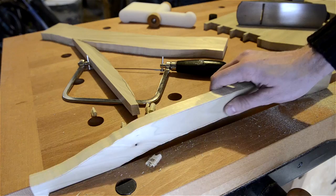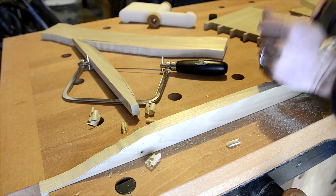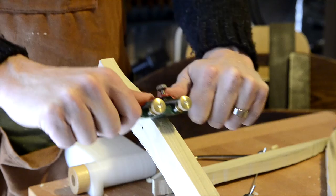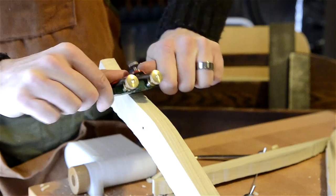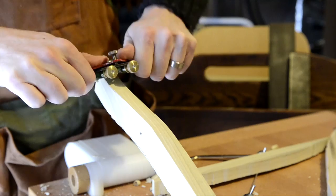You can see the handle is cut out but rough and not super close to the lines. Before using the spokeshave, I like to use a hand plane to get closer to the line, especially on the flat sections. Then I use a spokeshave — traditionally used by wheelwrights for curves on wheels — pulling it toward you. I like it because I can get in really tight. Work at it until you get rid of the saw marks and refine the curve. You can also use rasps if needed.